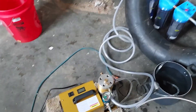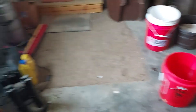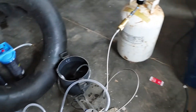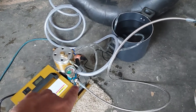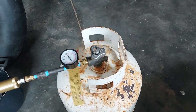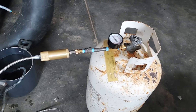I've got a bucket of water here and a fire extinguisher from like the '20s in case of fire. Another thing to be careful about: before you turn the air compressor on, you want to make sure that downstream is open. If you open it with this valve closed you're going to over-pressure everything and possibly cause a big problem.